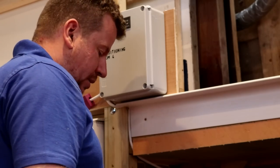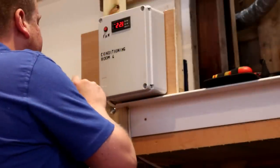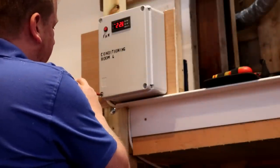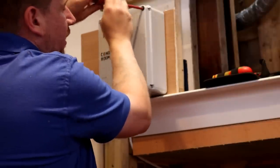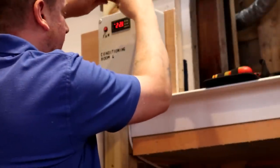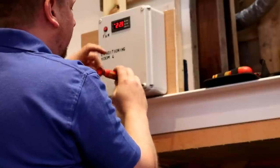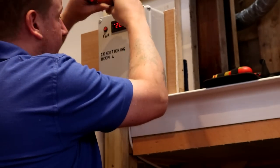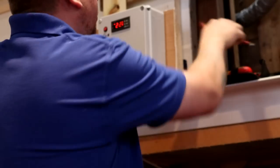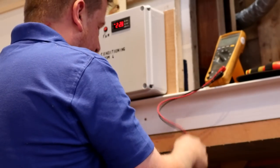So I'm going to start with the easiest check first, and that is to check that we've got voltage on the 12 volt supply that actually powers that particular motorized valve. So the easiest thing we can do is pop open the cover, bearing in mind that all the electrics in here are live at mains voltage. We'll get our multimeter out, we're going to set it to DC, and we're going to go in and have a look